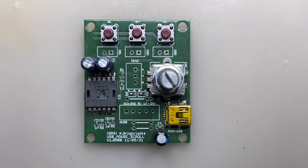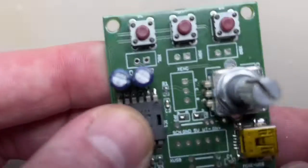I saw that most of the cheap mice consist of one chip that does everything. This chip has an onboard camera — low resolution, of course — it handles the encoding for the buttons and the scroll wheel, and of course the full USB stack.